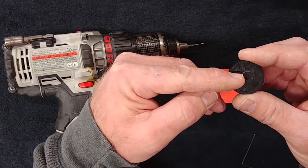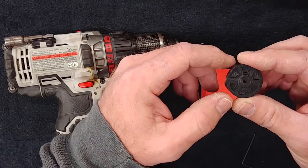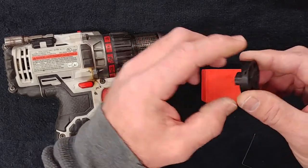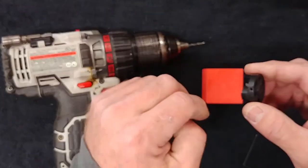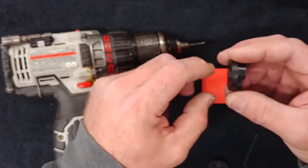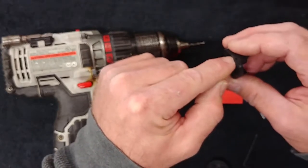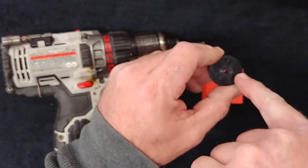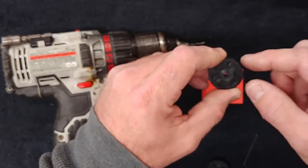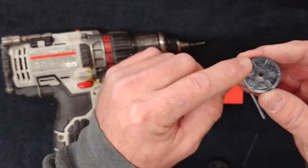That's even worse. It's better to bring the impeller off to one side so it doesn't rock anymore — it's forced against one side and it can't rock. What you're going to do is offset this weight difference by drilling. I'm using a cordless drill with a 3/32-inch drill bit and I drill small pockets inside these pockets. As you'll see, I have one here that's somewhat pre-balanced. There's the set screw hole, and then two counterbalancing holes to lighten up one side. They went into these little pockets here. You don't have to drill all the way through — you just need to break through the side to remove a little bit of material and lighten up this side to match the weight on the other side.